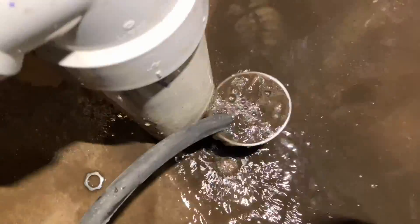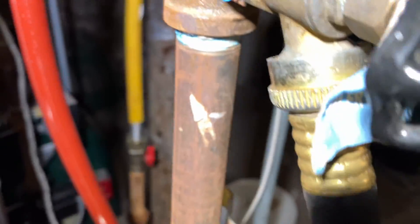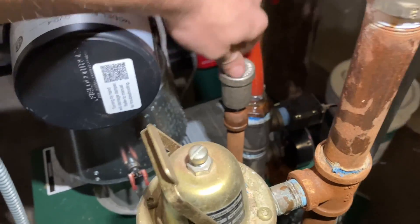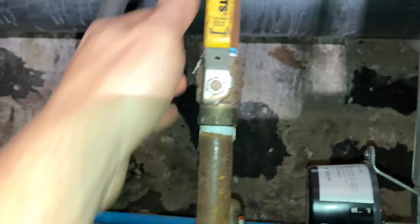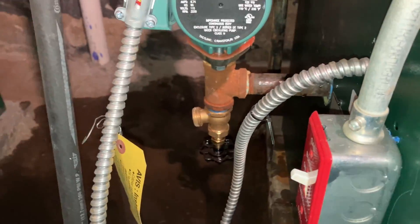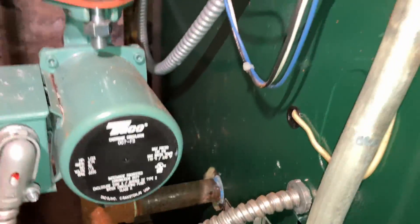Open it, get all the air out all over again. That's cold — you should also be able to hear it too; you'll hear all the air in the line. Then it's just a balancing act. Open that up, valve is closed, open our isolation valve, feed valve is open, pressure is stabilized. Put the power on and wait for heat. The thermostat's calling — we're going to sit here and watch it and make sure we're circulating heat. We might have to purge a little more air, but with the new float vent on there I think we should be okay.